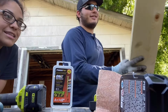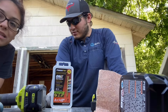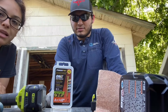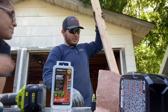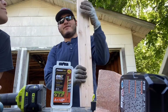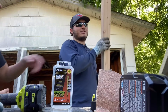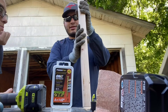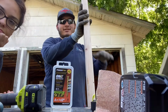And if you can't get your hands on some wood like this, you can always use the wood from the pallets after you're done making the frame part. You can always use those same pieces of wood to put on the top. And then these are a little thicker. This is going to be the legs for the whole vanity. I bought 2 joints of these, depending on how high it's going to be. I figured better safe than sorry. These are more thick because thicker is more sturdy. If it's too thin, it'll be more wobbly and might tip over. So thicker is more heavy, and on all 4 legs, it's going to sit down pretty neat.